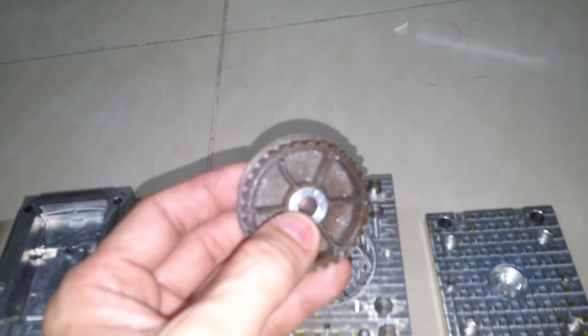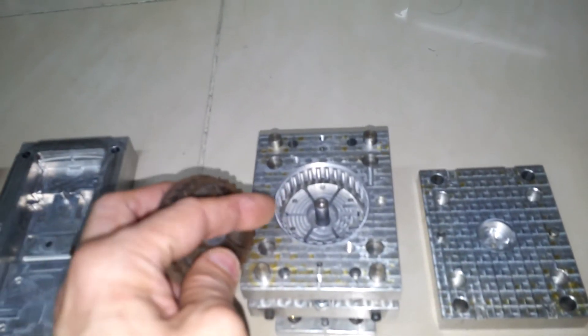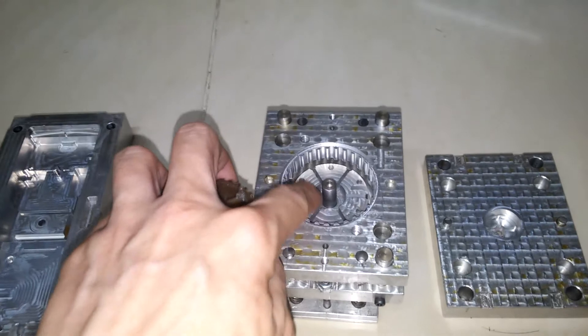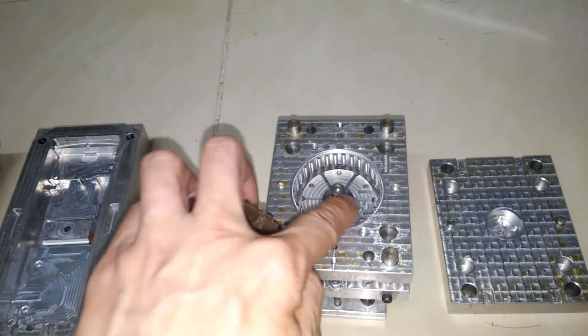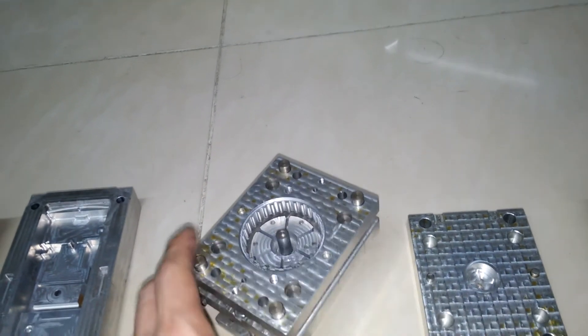The metal part inside will come out from the mold at the same time. So during molding, I need to put a metal piece — this aluminum bushing — here, then close the mold. The material injects into the cavities, and after cooling you take the disc out. These are the finished parts that came out.